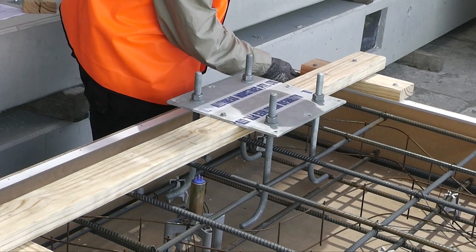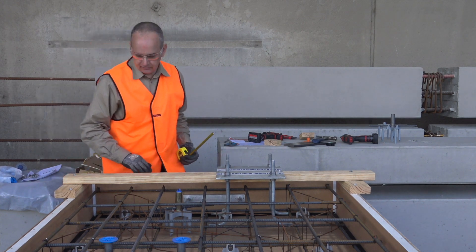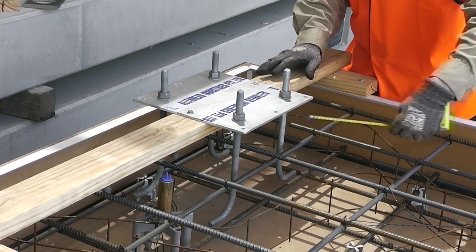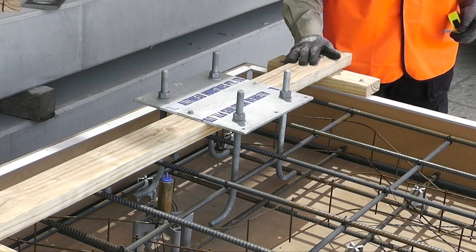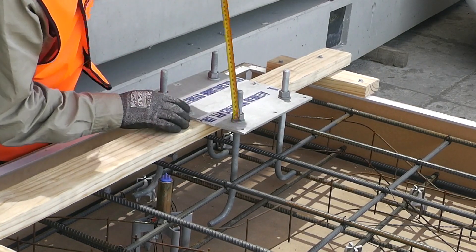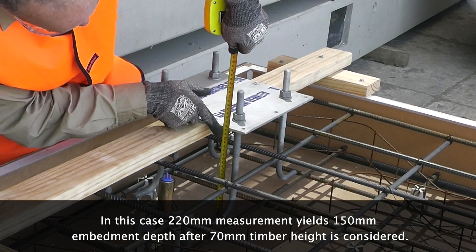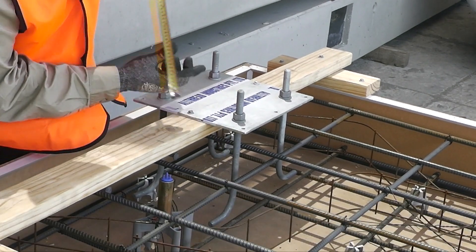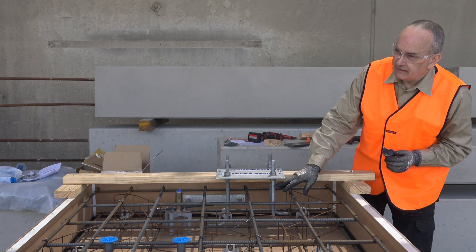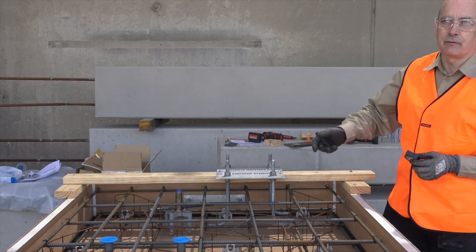Let's make sure we've got that dimensioned off. Across to this dimension we wanted 150 millimetres to our form, which we certainly do. Beyond that we have another dimension from our form to our plate, which is 100 millimetres — which we do. That's all screwed in place. The other dimension to check before we pour is to make sure our embedment depth is correct. In this case we needed 220 millimetres, and that's certainly what we're seeing. One final thing is to apply tape on the threads — it'll give us some protection against concrete getting in during the pour and enable us to move the nuts up and down readily.